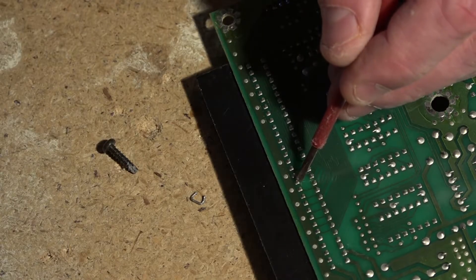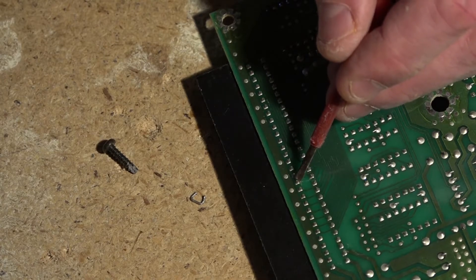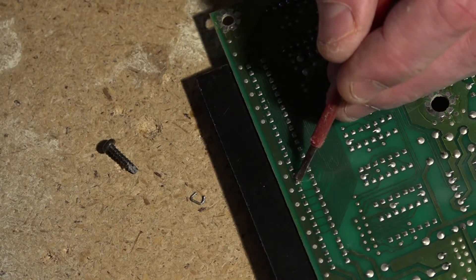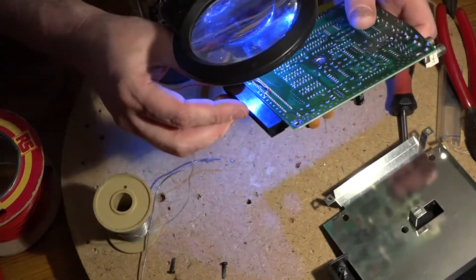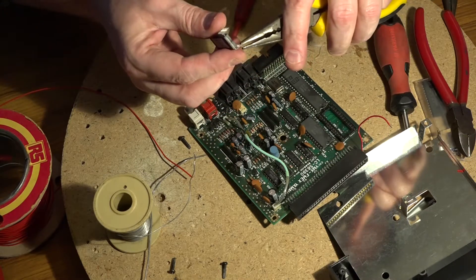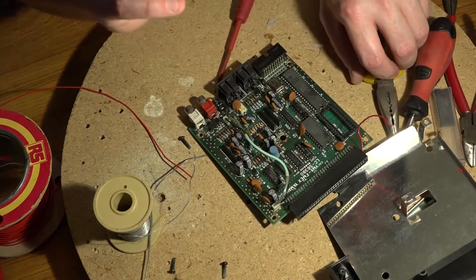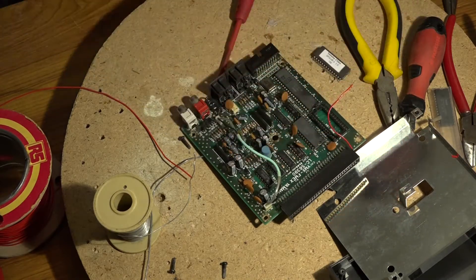But now what we need to do is put in this new piece of software. What I do know at least is if this new chip doesn't work then I can put the old chip back in and everything hopefully will still be okay. Where I'm pointing my screwdriver, according to the diagram I was sent with the chip, this is pin 35 and this is the pin that you need to connect a piece of wire to that will then go to the A14 of the chip. So the first thing I want to do is get a piece of wire and solder it to that point there. That is good and solid, not shorting with anything.